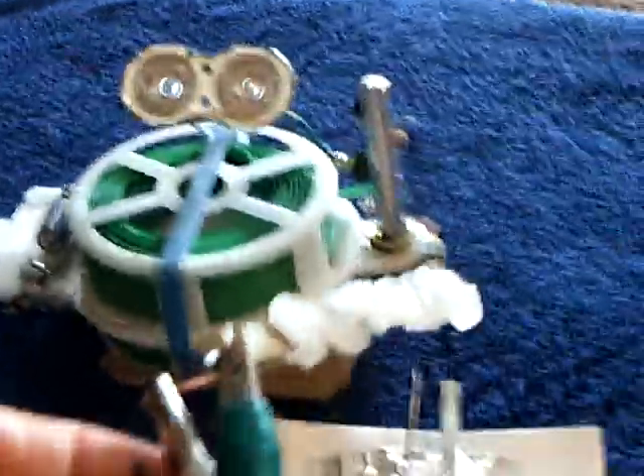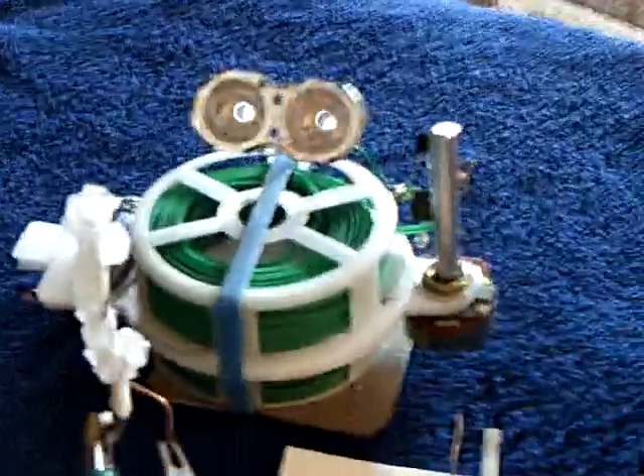We'll see how long this crystalline cell runs. I'm real tempted just to hook it up to Penny because it would look really cool sitting there next to Penny, running Penny. This other thing is hitting toward a month that it's been running, and it's not very bright — it only draws about 3 or 4 microamps the way I have this set up. It's a very efficient little oscillator, but it's hanging in there. I've taken readings twice a day; it's holding at about 0.9 volts.